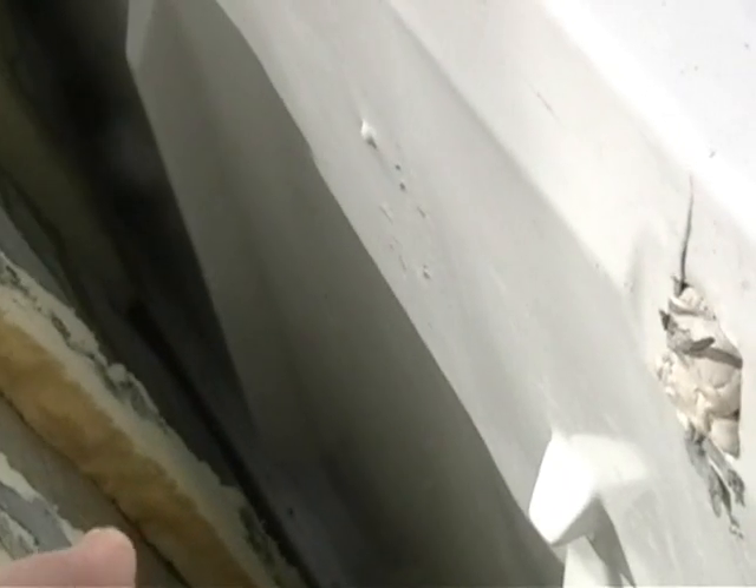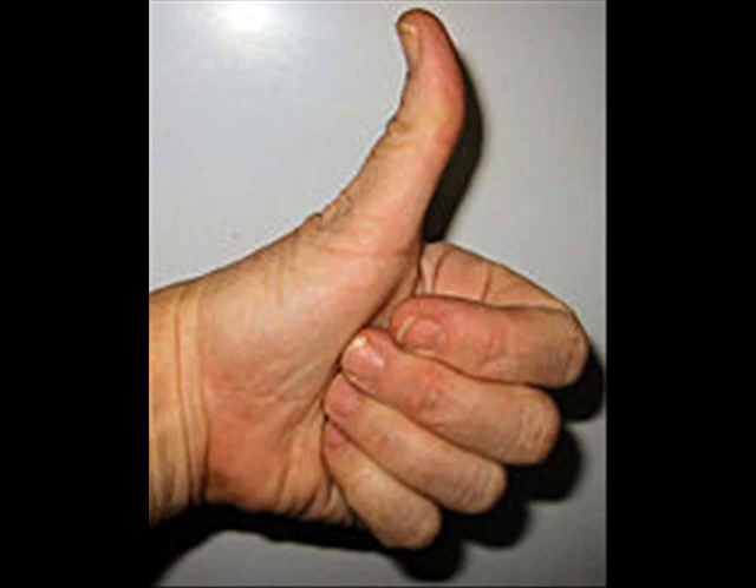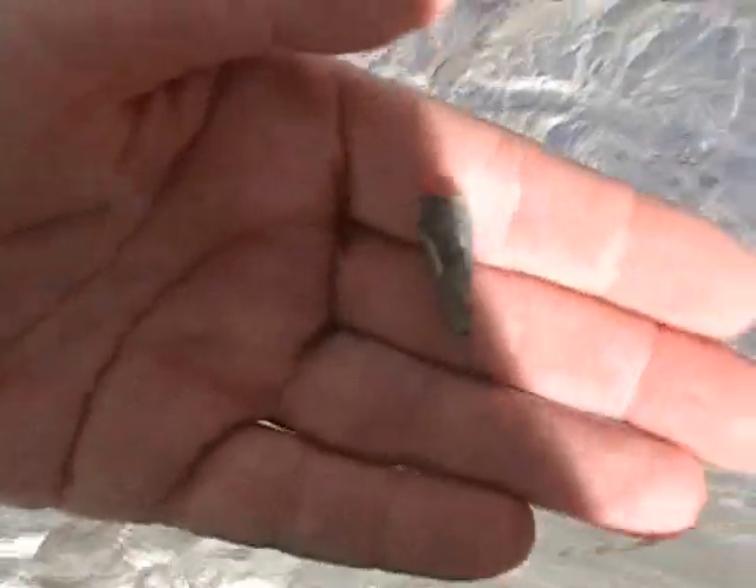All the way through the bottom of the bread box — I've got the tank out, by the way, it's draining — the caulking has all flaked off. All the reflector panel that I had glued up with it has flaked off from the side. That caulking didn't hold at all, so that is not the stuff to use on your bread box. The latex caulking is out. I've got to get silicone in. I've got to re-glue my sides and put the pipes back in with silicone.